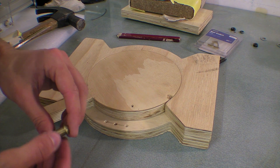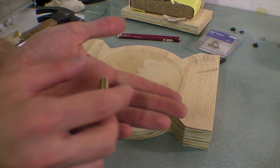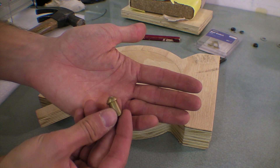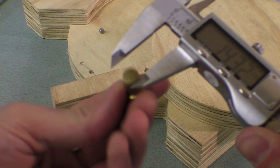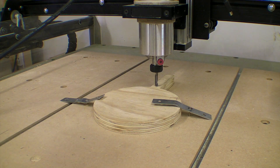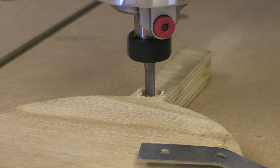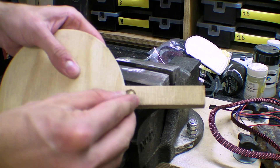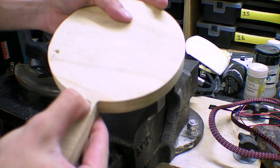I was struggling to find a compression spring, and when I popped to the shops I found a cylindrical ball catch instead for a couple of quid. It's simply a ball bearing housed in a collar in a tube with a spring in it. I measured the cylindrical ball catch using the vernier caliper and set up the job, preparing a test cut on the prototype. I made sure to add half a mil to the shapes in the software so the fit wouldn't be too tight, and homed the machine from the centre of the circles. Once complete I pushed the cylindrical catch into the opening using the vice and tested it out.